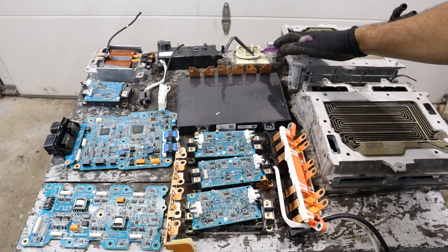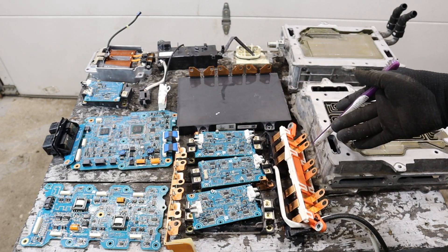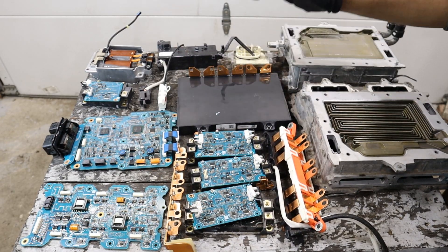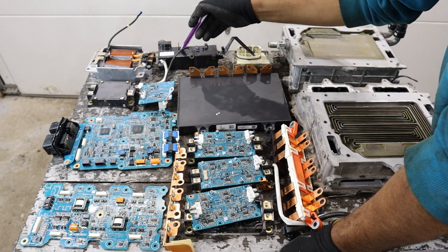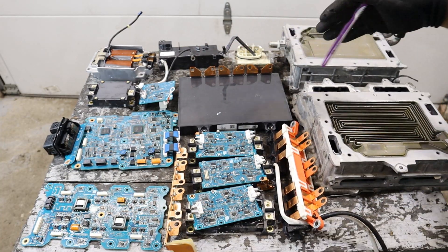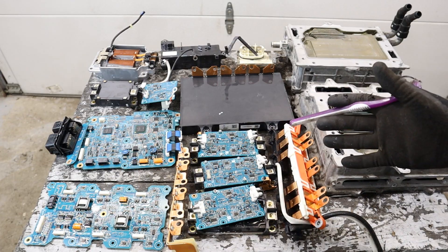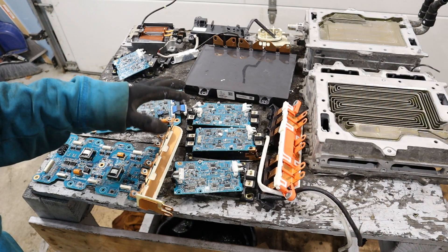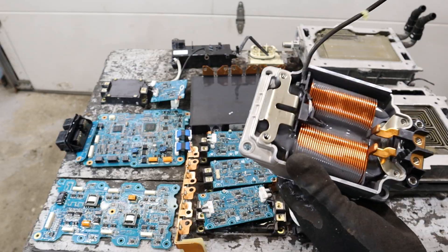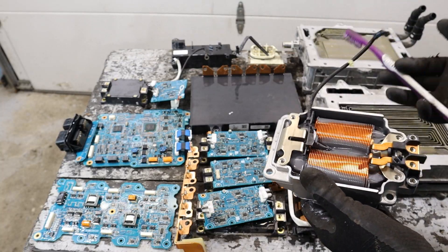Essentially 270 volts DC comes in from the battery pack. The electronics here control the IGBTs to take that DC and turn it into AC current to control the transmission. When the transmission is regeneratively braking, diodes inside work along with the smoothing capacitor to send current back to the battery to get it charged. The reactor capacitor and its IGBT switch on and off to boost up that voltage for more power out of those electric motors. The communication module feeds back to the vehicle, and the coolant circuit keeps the temperature of these electronics under control. This one is actually missing the DC-to-DC converter because it's located on the battery pack, unlike the Toyota system which puts it inside the inverter. If you want to see the engine or transmission teardown from this vehicle, stay tuned for those videos, and subscribe if you want to see more videos like this one.